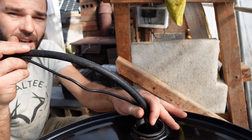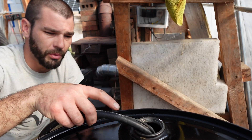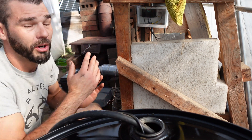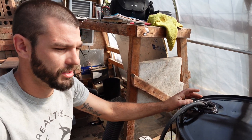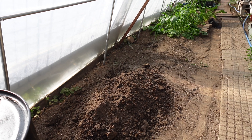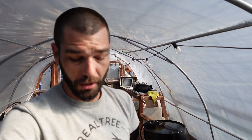We've got this pump going right into the tank. I'm so glad I was able to pick up this 55-gallon drum — it had soybean oil or canola oil in it, something natural where I wasn't going to poison soil or water. I washed it out with dish soap, so now we can use it to hold and heat water. With this pump we'll be able to recirculate water back and forth between our stove. I also want to incorporate a little heat exchanger — possibly on top of the drum before the water dumps back in — to pull some heat to the air and blow it into the grow tunnels that run down the whole side of the greenhouse.